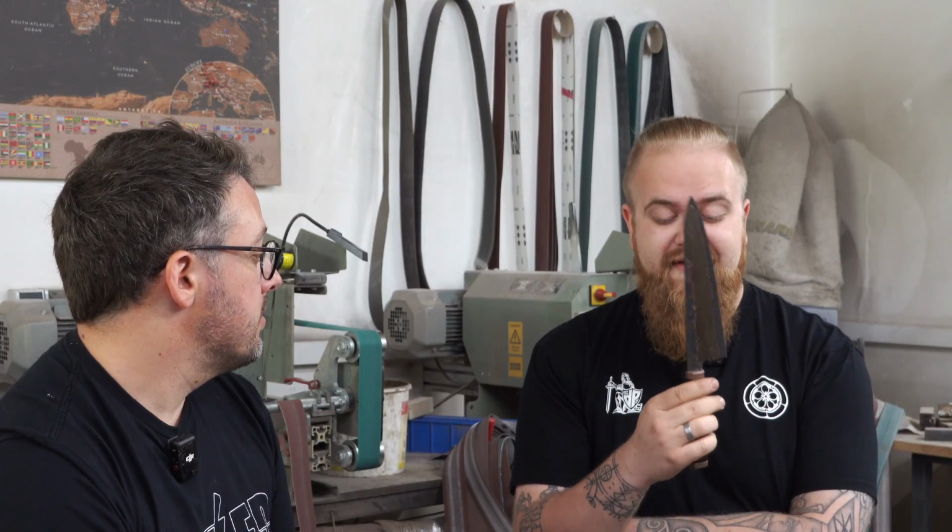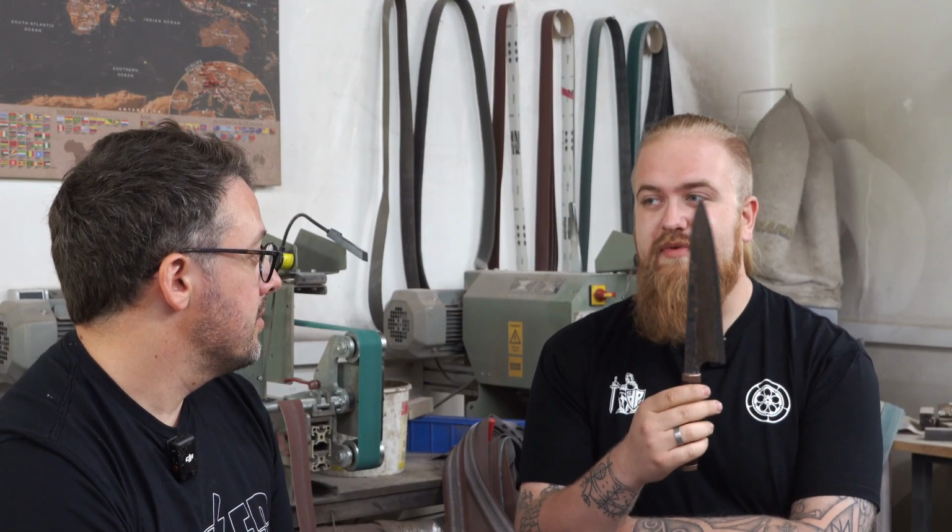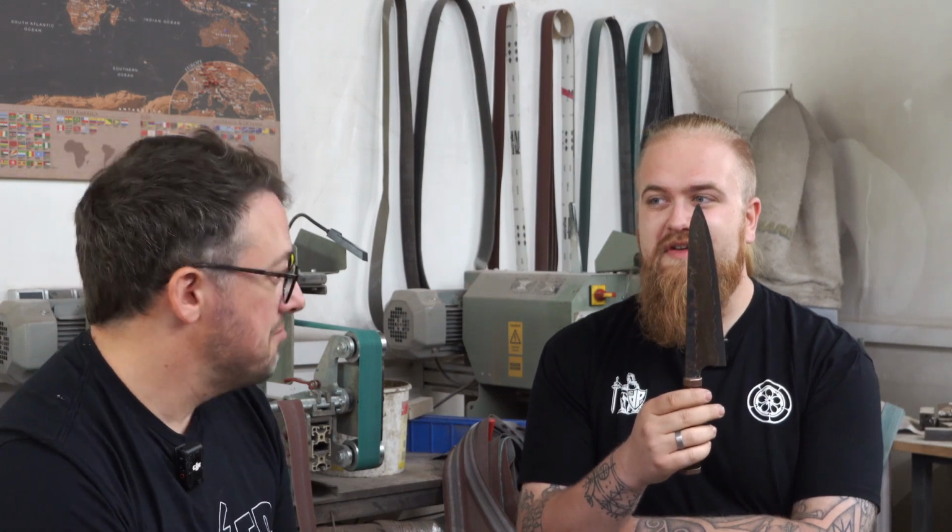Sure, it is tricky to forge. It doesn't like to be overheated. It doesn't like to be too cold. But again, why work with the heat treat ovens? Perfect for this. I started to forge all my Apex laminates in the heat treating oven right now because, as I said, low stress. Put it to the temperature that I wanted.